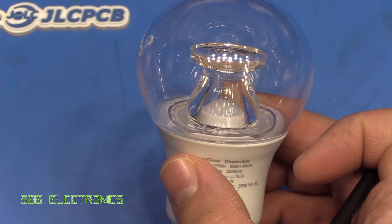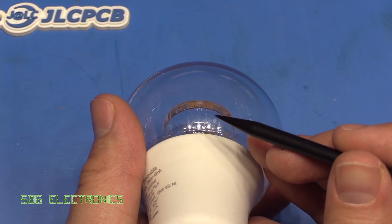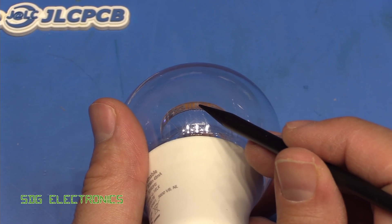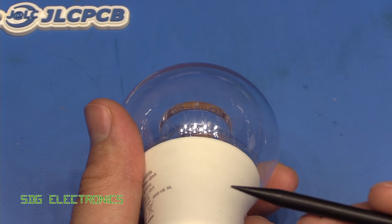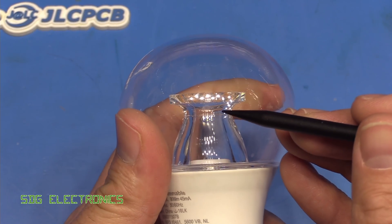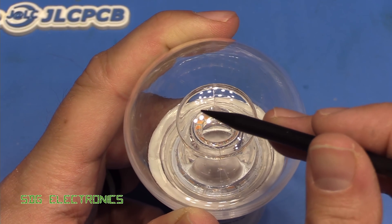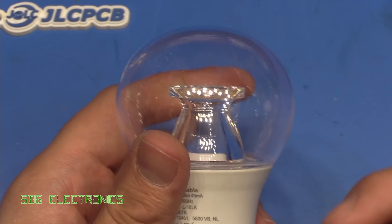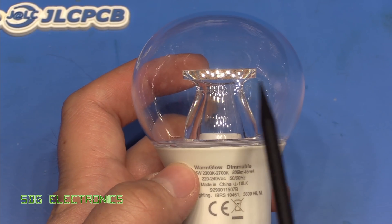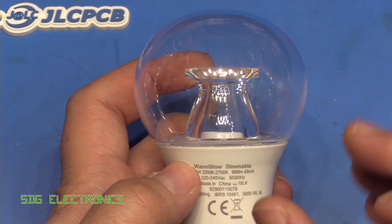Something I hadn't really appreciated about this lamp — which I've actually had running for quite a long time — is that no matter what angle you look at it, you can actually see the LEDs through this optical piece in the centre. This is going to be quite difficult to film, but you can see the LEDs all the way down here, and still see that orangey effect going up. This really nice optical structure — all plastic on this one — gives a very nice light output and gets away from needing a remote phosphor setup to achieve a nice distribution of light.